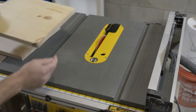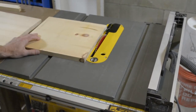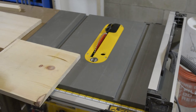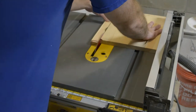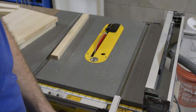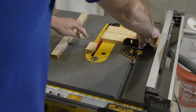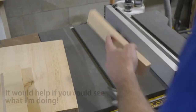Once you've got your wood sourced and ready to go, let's start by cutting the slats. The slats, as I call them, are the little rails that the wine bottles actually touch when resting in the wine rack. Begin by setting your fence to 10 inches — this is going to be the total length of each slat. Next, cut them to the final width of about three quarters of an inch.